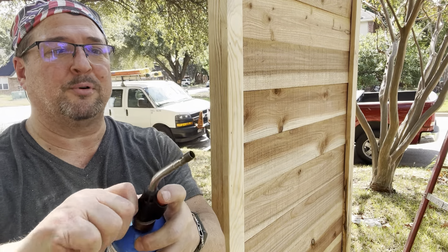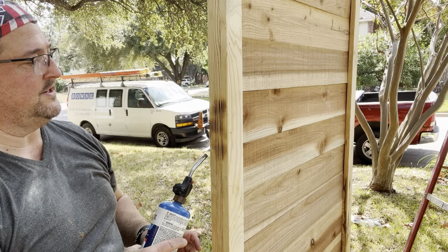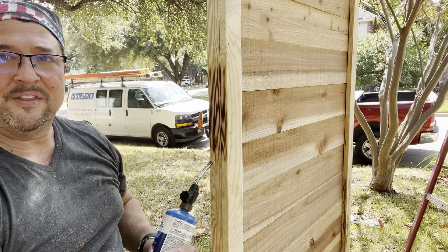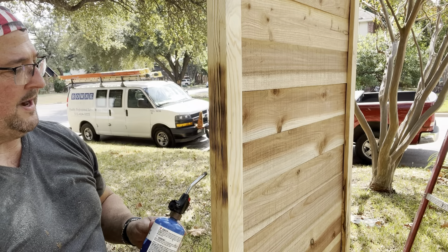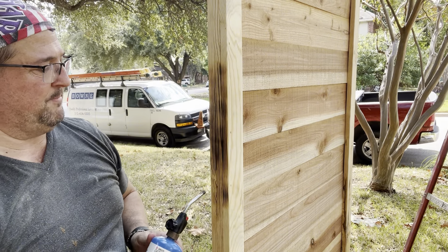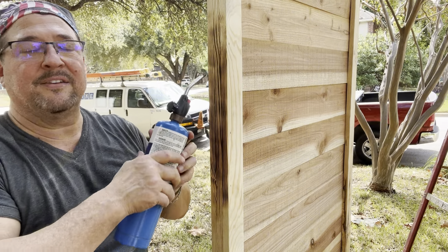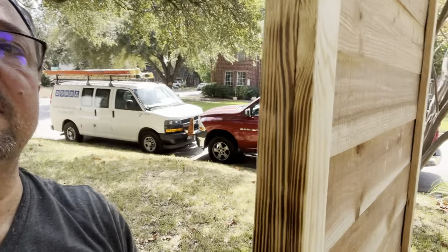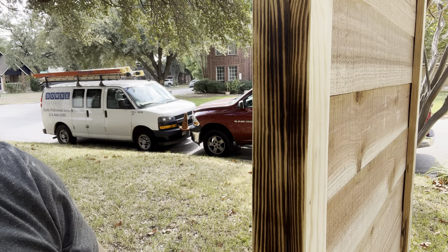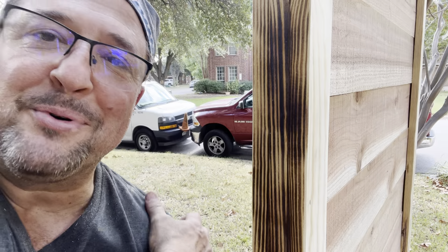So now all I'm going to do is just take this little propane torch and hit all the frames like this — just get some of the grain to pull out. I'm going to have to remove the cedar boards because I don't want those burnt, I just want the frame burnt. If this takes too long, I'll bring out the bigger torch. You get the idea, right? I don't know if you can see that grain, but it looks really good like that. And you can just put a little bit of finish on it, or not — doesn't have to have any kind of finish on it, for this purpose anyway.